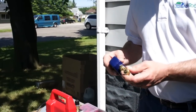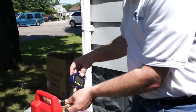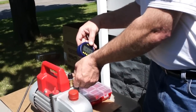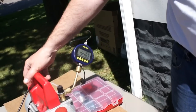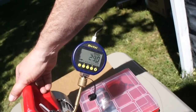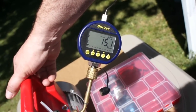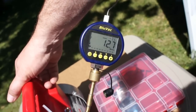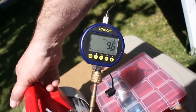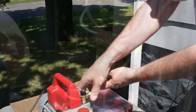Alright, so we've got a small amount of Nylog already put on all the fittings. We're going to go ahead and test this pump out and see how far down it will pull on its own. The pump is already down to below 17 microns, 15 microns, 14 — so the pump is very adequate for doing what we want to do. It pulls down to 9 microns.